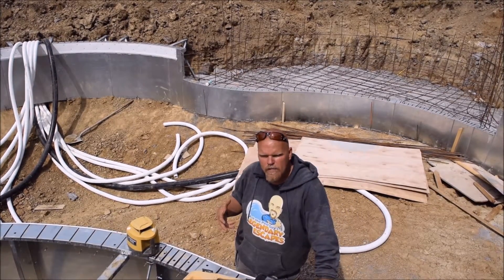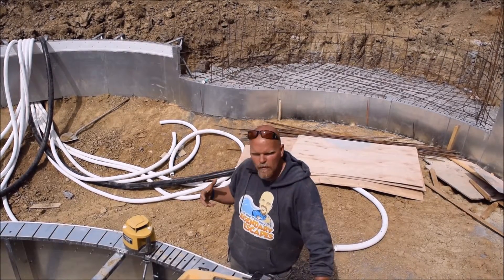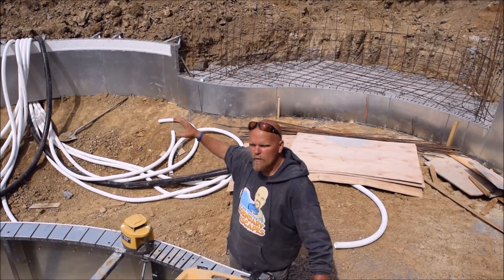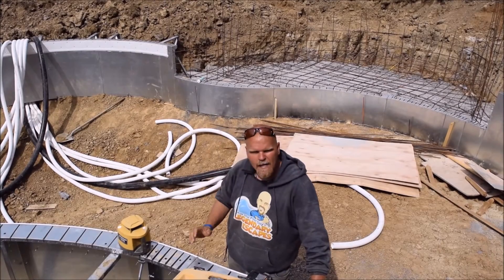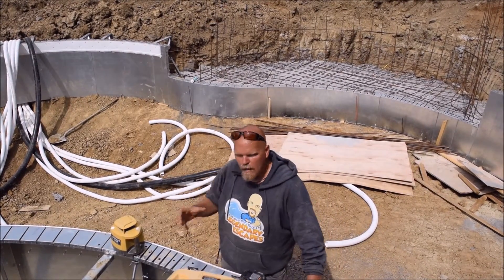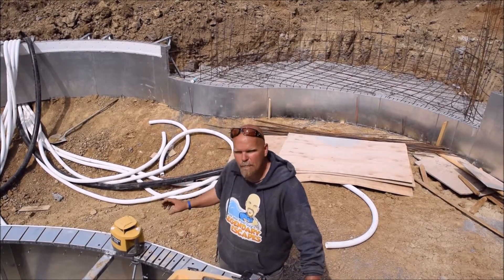This could be done in rigid pipe, which in a lot of cases rigid pipe is fine. When we're dealing with the soil that we're dealing with here and then getting up through the wall and not wanting to degrade the footing around the wall, I tend to like to use flex because it allows me to dig a hole through the footing before the footing dries up and I can feed my pipe through there.